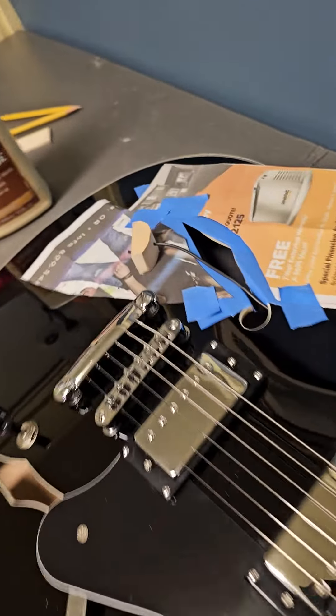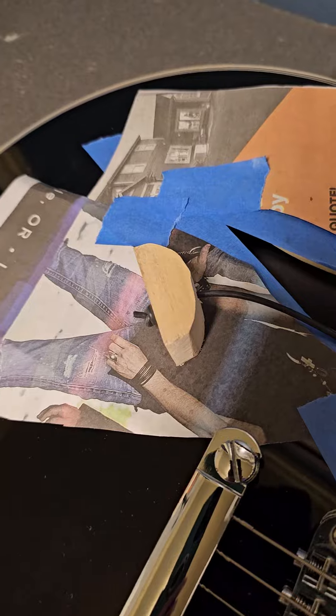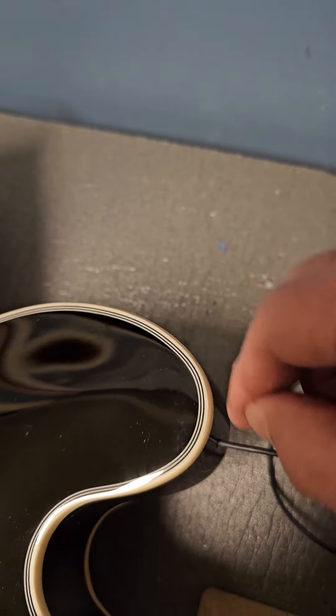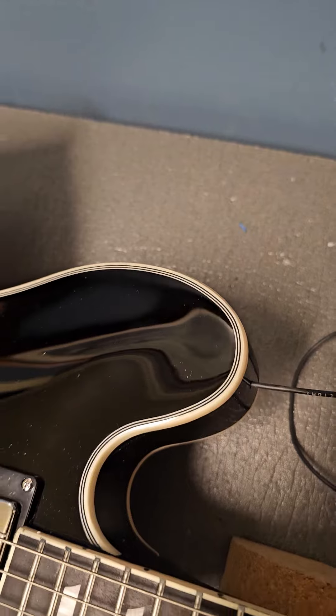Then you make a block that's cut to the radius of this, and it's real simple to do. I stuck a little piece of cardboard back here that was solid, then I just traced around there and got that horn angle. Then I just cut it out on my jigsaw very easily.